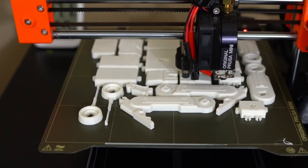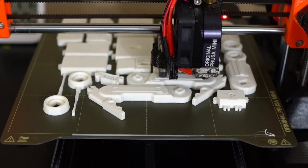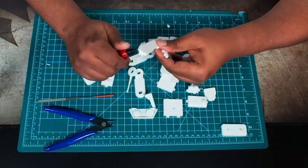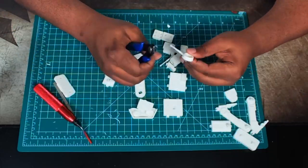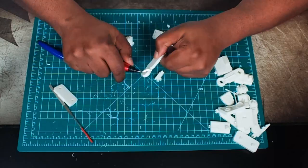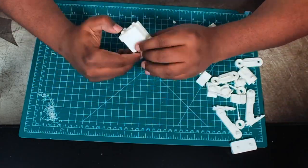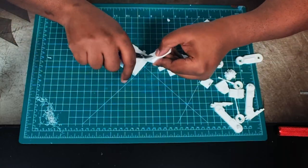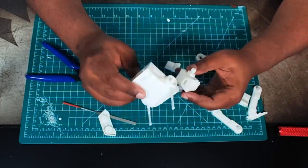I also did BD-1 in PolySmooth White. Working with different materials, you can really tell the difference in material properties. When I assembled the PolySmooth White version, it had the opposite tolerance behavior — the tolerance was too tight, and this material was not as strong as PLA. I was manhandling it a bit trying to poke pieces in, and the tabs and notches were breaking off — maybe four notches cracked.